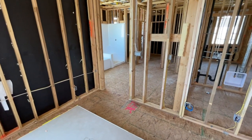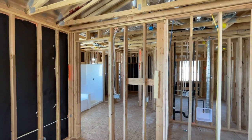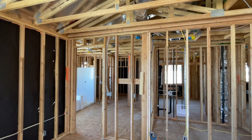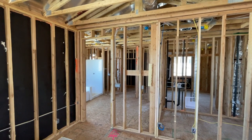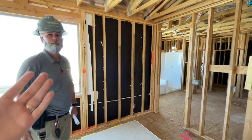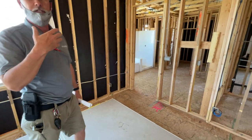People back in the days used to try to do their houses out of 2x6s all the way around just to get the R19, and that's even really gone out of the way. With the low-E windows, the vinyl frames, and the foam stucco, it's really more than tight enough. And taking care of all these details, the little holes that you guys are patching, all that stuff, probably makes more of a difference. That's exactly what makes the difference, is the actual loss, the leakage.